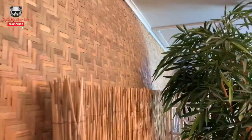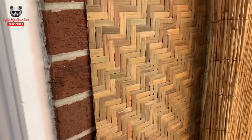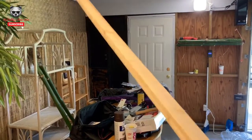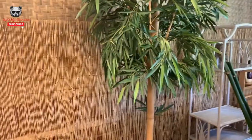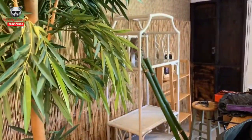There are not a lot of videos out there that talk about bamboo thatching. If you're thinking about putting it up — I have brick on the main wall I'm putting this against, you can see the brick down here. This garage was an add-on to the house. What I did is I put small strips, almost like two-by-fours, on the brick itself and used them as anchors. I anchored them down — you can see one right over here — to act as additional support, and then I literally just stapled the thatching to them.